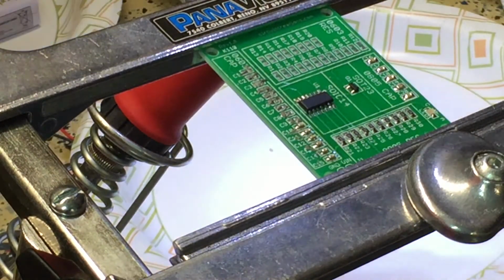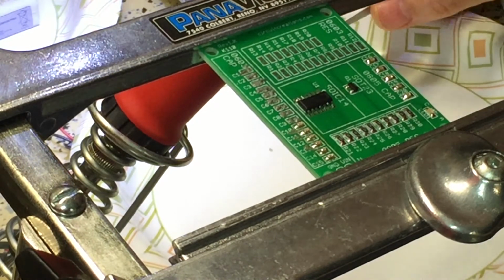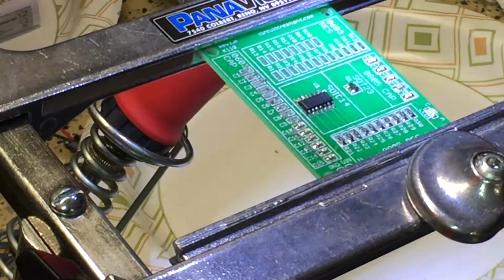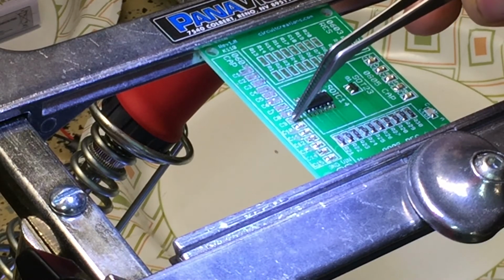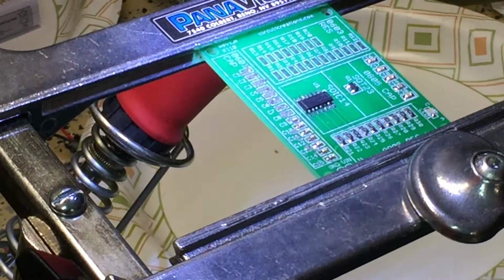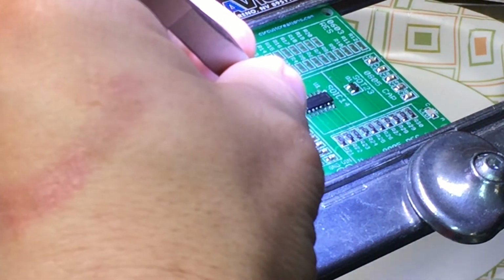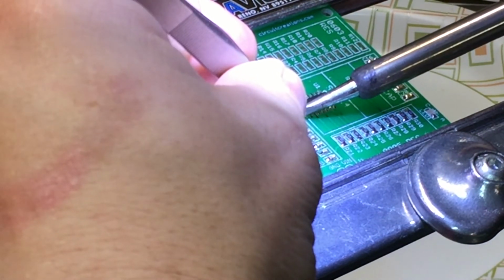Although I think if we're going to do this beyond the Trackuinos, the $200 in a reflow oven would be worth it. The only other thing would be if you were doing large circuit board productions, the way they get this solder paste on here, it appears, is that they use a stencil, kind of like screen printing, and squeegee it on, and then put their components on, and then put it in the reflow oven.